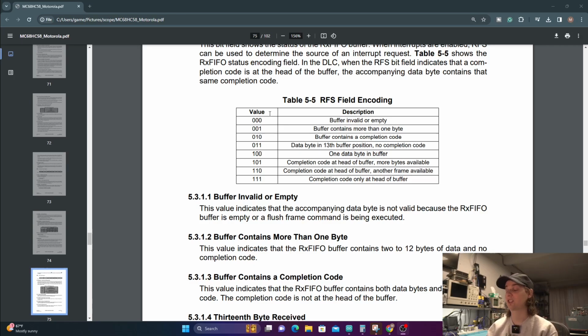So let's actually take a look at what I wrote, which was my quick example of reading it. All it does is sit there and try to read it. It's constantly sending that flush byte to read the buffer and read the entirety of it. I'm not manipulating them into a message. I'm just sending them one byte at a time back to the computer. This was just a quick and dirty way of trying to capture data from this chip.